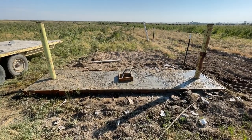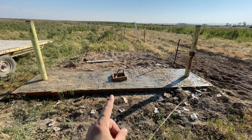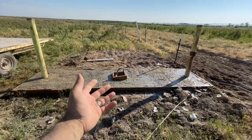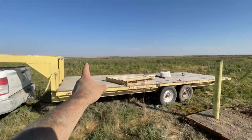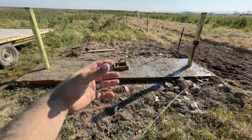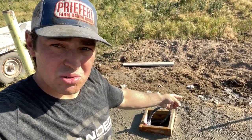There we have it — a poured concrete pad. Is it perfectly level? No. Is it going to be nice pretty concrete on top? No. Is it going to be solid enough for me to bolt the water tank to? Yes — that's all I'm looking for. This was hand-poured out of bags with water mixing. The concrete will draw moisture from the ground, and the pivot is going to come around and go over the top of this tonight, so it'll get another dousing of water. By tomorrow when I come to bolt the water tank on, it will be nice and solid. I'm Jesse, this is American Beef Ranch — thanks for coming along with me the last couple days. Check back in tomorrow — we'll get this water tank in, some H-braces, and other stuff, because I've got to move my cows to some new pasture. Thanks for watching — please like, subscribe, comment, check out the links in the description, and support your local producers if you can, because right now is a really tough time to be a farmer and rancher.